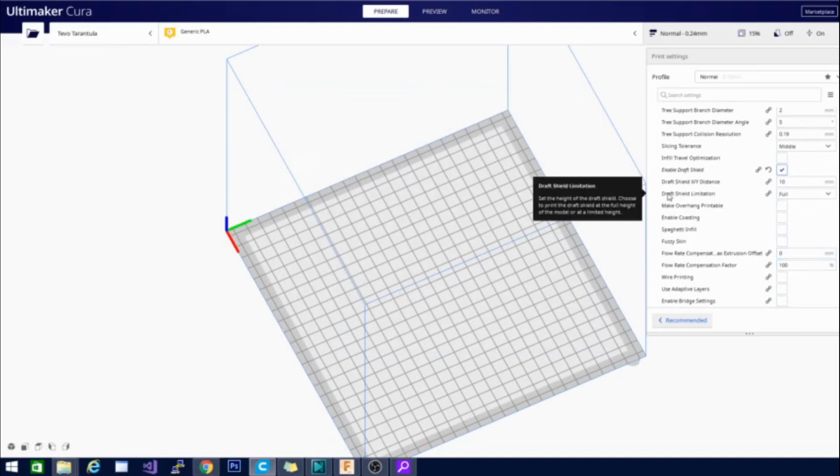The three main things I can tell you about printing ABS are: pay attention to the temperature of the bed and pay attention to the temperature of the filament — both of these are listed on your filament package. You also need to be aware that if you have any sort of temperature variance in your room, you are probably going to end up with cracks and warps in your model. ABS requires a pretty steady temperature, and as the bed and nozzle temperatures move further apart, there's a chance that the temperature in the middle of the model could be reduced quite a bit, and that change can cause the model to crack and split.